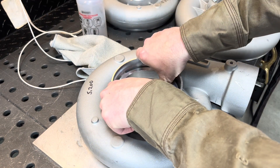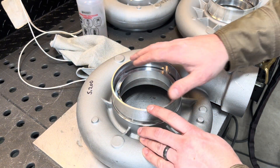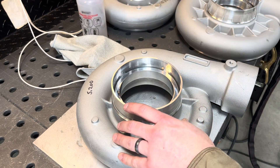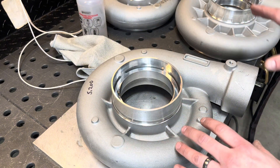The most important thing is that we make sure this is sitting all the way down before we weld it. We're going to go through, wipe this out with some acetone, and throw a little bit of preheat in it. Then we're just going to stitch these in. I've got five of these to do, so we're going to go through and do them.